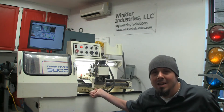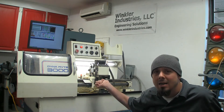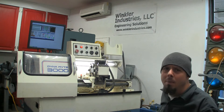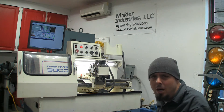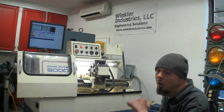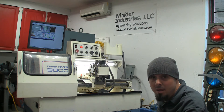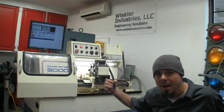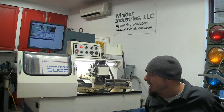That fluorescent light seemed really dangerous to me, so I got a direct replacement — similar to what I did for my overhead lights in here. You don't have to bypass the ballast, you just pop it in. It's an LED direct replacement bulb. It works great, super bright. There's a plastic housing around the actual LEDs, and I'll probably still put a plexiglass shield around it just to keep anything from flying up and hitting it.